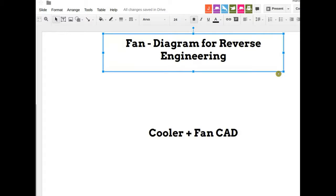So it'll most likely be, perhaps, a plate. Where's the mounting base? Is it on the bottom or on the side? It's on the bottom, right? It sits on some flat surface, right? Do you know? It should be on flat, yeah. Okay, flat on the bottom, right? So you got a plate. That means you need to mount that plate within the frame somehow. So probably do like vertical connectors, and that plate mounts on each side, right? So that's what you need to do. But you need the bolt pattern for that plate.